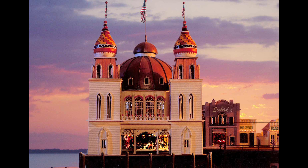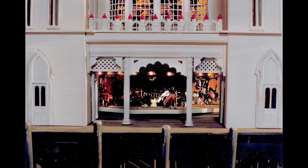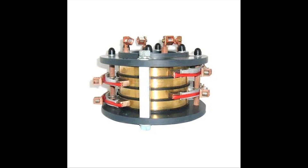Back in the dark ages, in the 1980s and 90s, when I was building a huge HO-scale railroad in my house, one of the things that I built was an amusement pier with a fully functional carousel — HO-scale, mind you — with horses that went up and down and 30 individual actual incandescent lights. This was before surface mount LEDs, so I was using 30 incandescent axial lights at one and a half volts, and I needed some way to get power to those lights as the carousel was rotating around. As a kid, we actually had a carousel right in our neighborhood, and I even worked up there, spending a lot of time figuring out how it works — which is why I decided I wanted to model one. I was very familiar with the huge slip ring at the top of the mechanism that carried the power out to the lighting for the carousel.